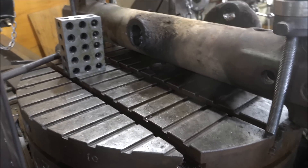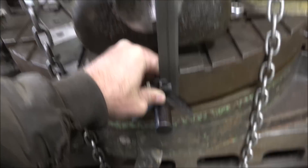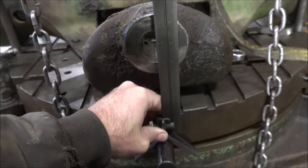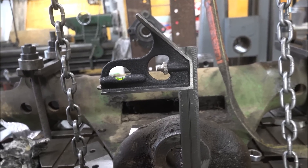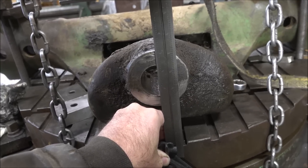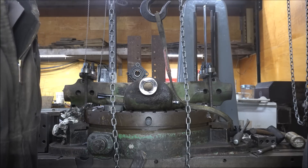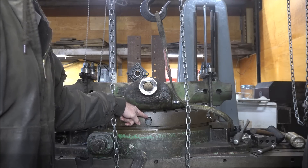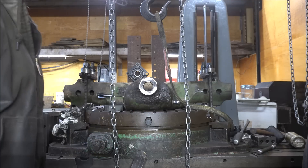We'll assume I got that part right. The next step comes in here with my center finder on the pin in the rotary table, which is the center of the rotary table. Tipping it till we're level — it's hard to do one-handed. We'll say right there. Look at that bore — it looks like we're right on line. Do the same check on the other side and it checks out good. The next thing to do is to move this over and get the spindle of the mill on the centerline of the rotary table. Check that the rotary table is on zero degrees.